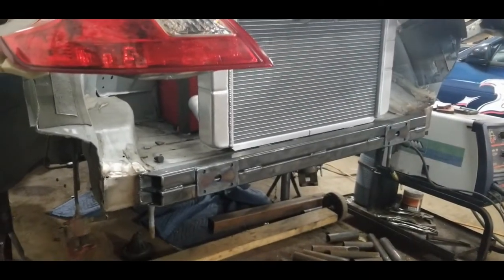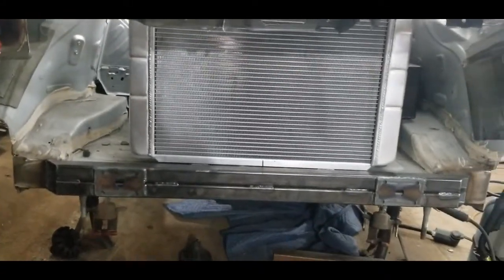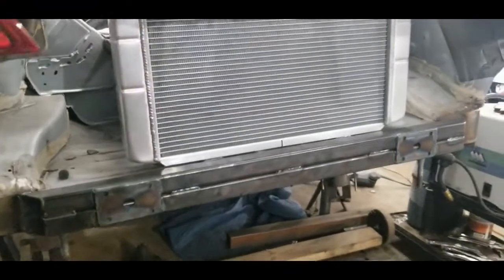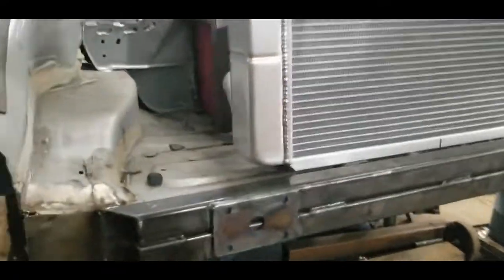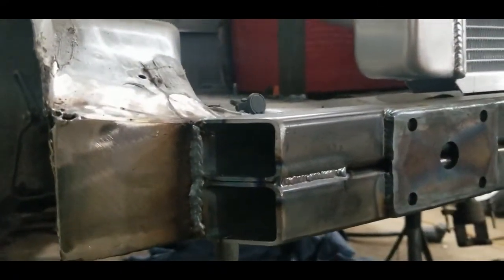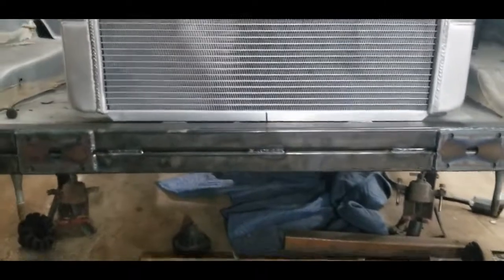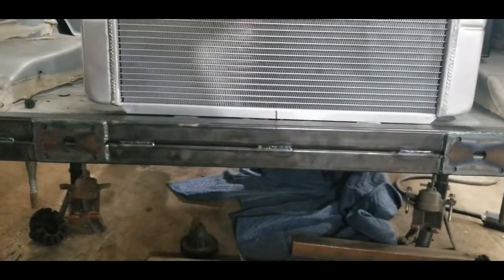All right guys, so pardon the mess again. We left off with putting the caps on the frame rails. Next thing we needed to do was make the base mounting structure that our tube rear is going to attach to. So since we removed all of this weight from the rear by cutting everything out here, we don't want to put all that weight back in. But if we do have to put weight back in for an incredibly rigid structural component like this frame tie right here, one of the tricks we do is that instead of using rectangle tube, you'll see that we actually stack two pieces of square tubing together. That gives extra reinforcement and also added weight that we get to place exactly where we want it, which for us is super low in the chassis and as close to the rear axles as possible in the back.